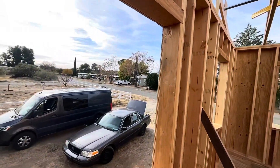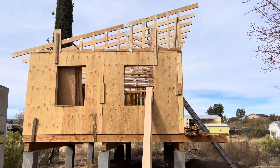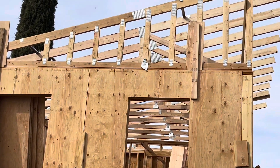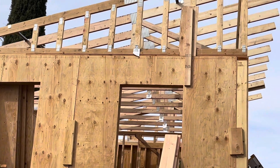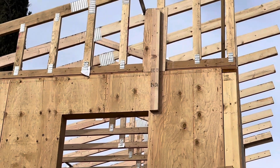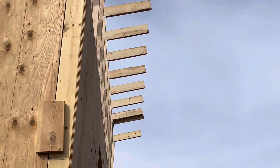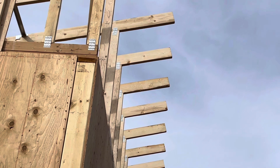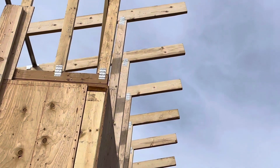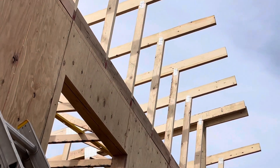Remember, I routed the windows — you see how clean they are? So this is what it's looking like. I wanted you to see the outside. You can put these temp blocks up, and what I did was I put the plywood behind there because that's the thickness of the shear. I'm going to have to continue the shear up on the truss. Here's the overhang — it's very slight. I am going to try to box in underneath those and put some can lights up, just a couple.